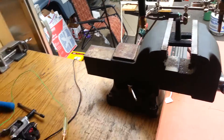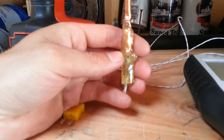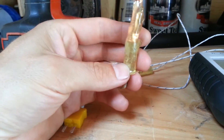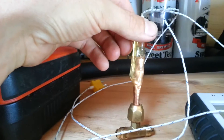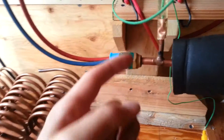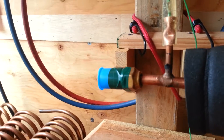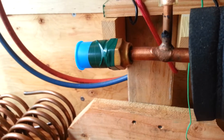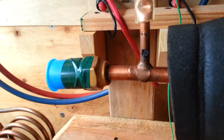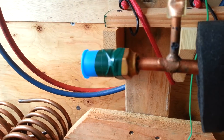I went through a few versions until I got to this point — I've got a few scrap ones here. This one blew out. You can see that it was tried — I tried to re-coat it a number of times. That was kind of when I was discovering the problem with the fiberglass. This one here is good — it's a little ugly, but it's a very early version. This was previously done — the last one I made is probably the nicest one. This epoxy is clear; some of the other stuff got kind of a yellow tinge to it. This one's for 3/8ths — the first 3/8ths one I tried to make, I screwed up and it drizzled down inside the brass tee, so I just made this tee quick and that one works just fine.